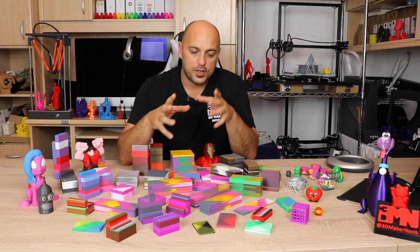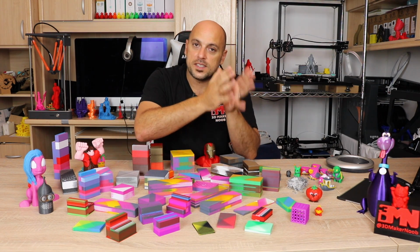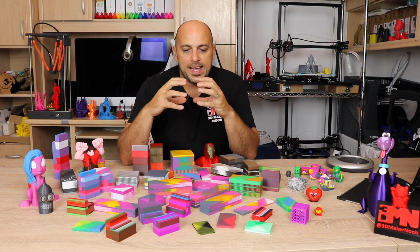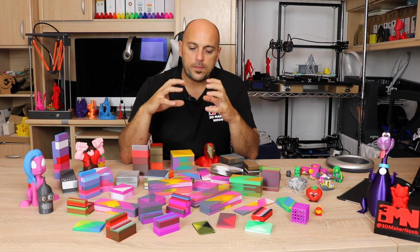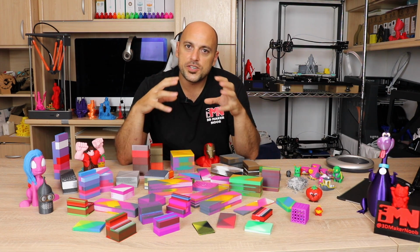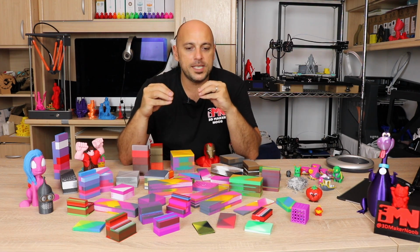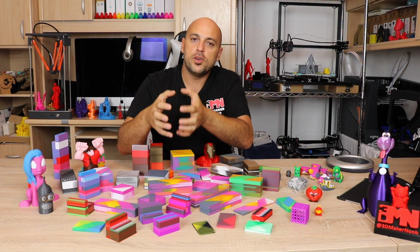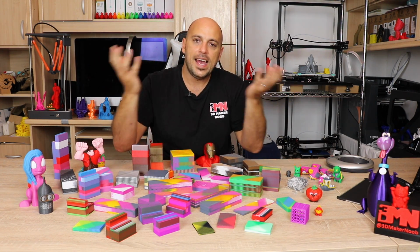As a high-level overview, in order to print something with the Palette Plus, first you slice a model in your favorite slicer. You then transfer it into Chroma, which is the Palette slicer, and Chroma grabs the model, adds a purge block to it, and gives some instructions to the Palette, such as how fast the travel movement of the printer is, and it tells the Palette when it should be splicing the filament and so on. So what you do then is you save a copy of the Chroma sliced G-code for the printer, one for the Palette, and it starts printing.